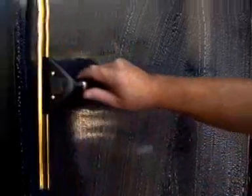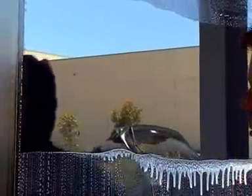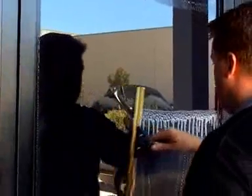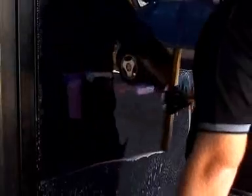It is very important to only apply a small amount of pressure. If you can still see a film on the glass after using the squeegee, then you have used too much pressure. To learn how much pressure to apply, squeegee the glass with the normal amount of pressure you would normally use. Then do it again with half that pressure and see if it still worked. Then do it again with half that pressure again. Remember, if you have a bad rubber, then pressing hard will not fix it. Pressing hard will cause the squeegee to lose its sharp edge and not remove the water.